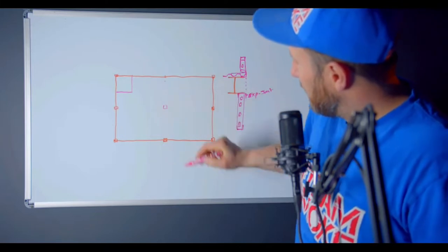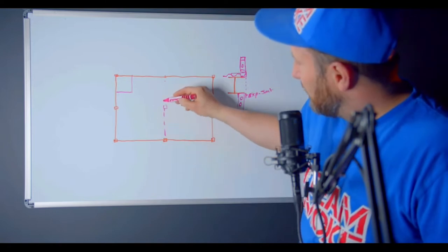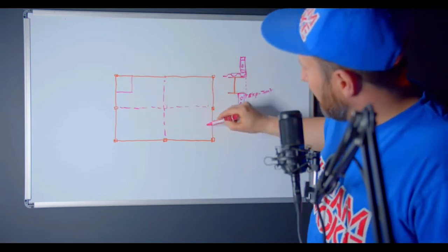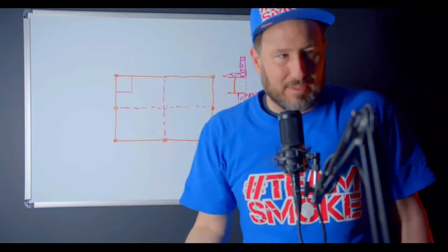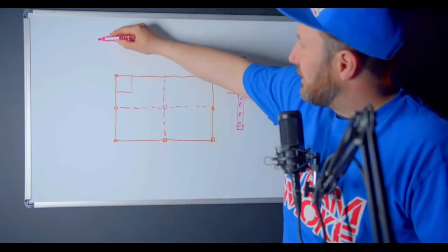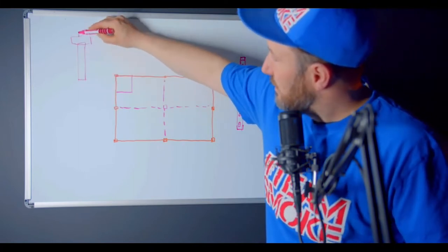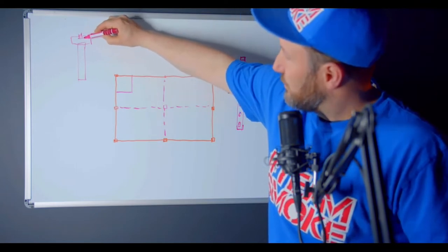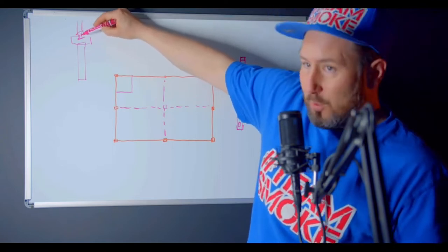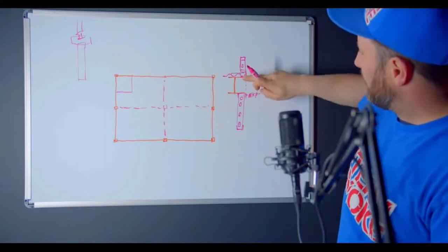Say there'll be one here at least, and then there'll be a grade beam sort of thing. There'll be concrete all the way around, and then the slab. The piles go underground, and then they get capped. Then there's a plate that'll be embedded in the concrete for the columns. The column will be attached, and from the columns at the top, there'll be I-beams.